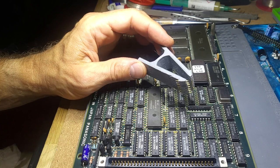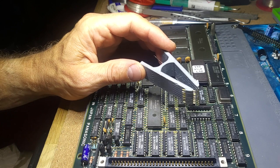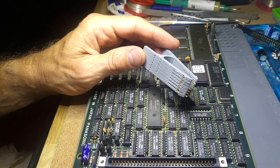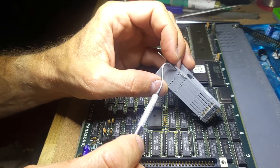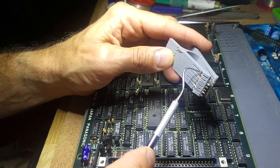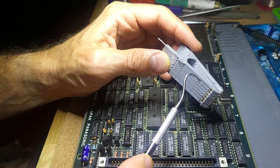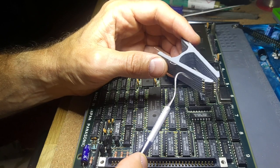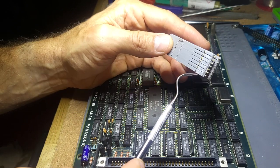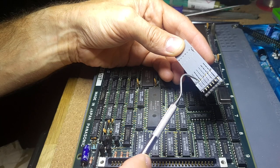So here I have the first clip. It wasn't as easy to build as it looked at first. Generally the problems were related to holes which were designed to insert contact pins and wires — the holes in my print were clogged with plastic, but maybe it was a problem with print settings. I tried to reduce the flow but didn't see a huge improvement. For IC contacts it uses pins from a plain 2.54 mm pin header, pressed in using a hot soldering iron. It worked, but it's not ideal.